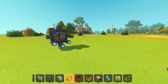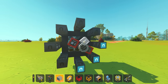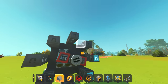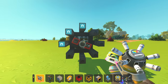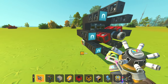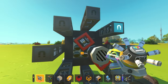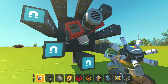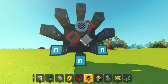I decided to take that motor apart and removed the casing - surprisingly it's not laggy without the casing. I built this a while ago and one thing I noticed: the magnets are all set to just this unnamed magnet configuration. We've got a spinning shaft here in the middle. When we turn this on, we're powering all the magnets in the middle to be constantly on, and then this sensor on the back wall controls the outer magnets when the encoder plate is in front of it.